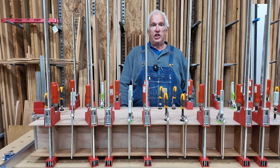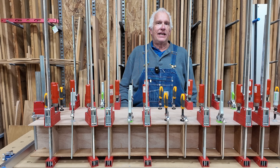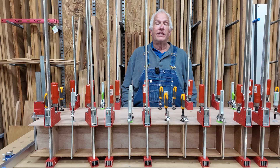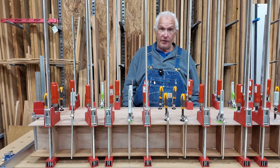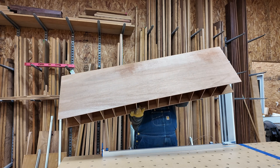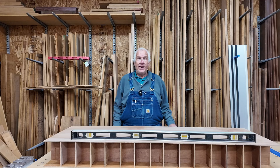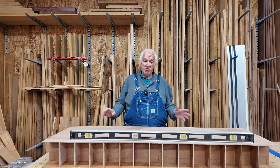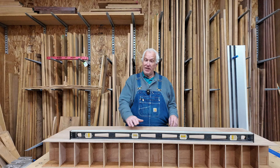Originally my plan was to just weight down the skins in lieu of clamps, but I did a little bit of math and I wasn't going to get enough clamping pressure without parking my truck on my MFT — so that wasn't going to work. The glue bottle says to wait 24 hours before stressing the glue joint, and I do plan to stress it — in fact I plan to torture it. So I'll check in tomorrow. It weighs 16 pounds; if it were a solid beam of the same size and material it would weigh 115 pounds. Making this torsion box really flat was not a priority and it shows. I checked with a precision straight edge — it's still remarkably straight and showing a low spot of about 1/32 of an inch in one corner, but the bulk of it is quite flat.